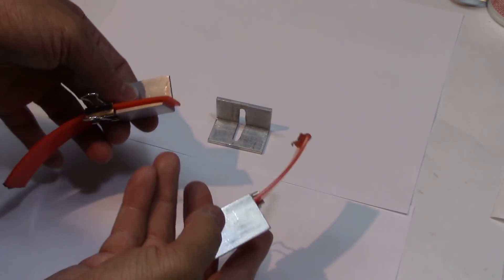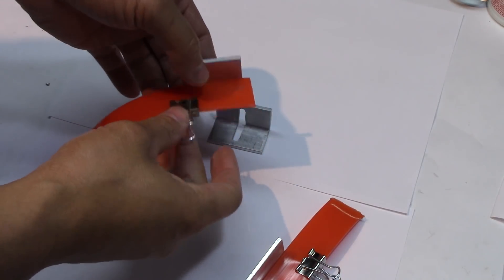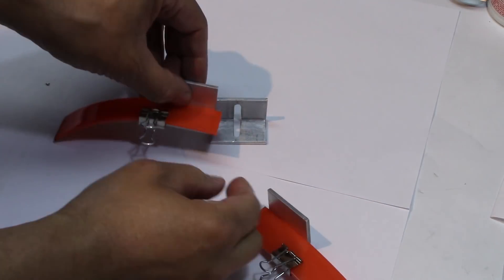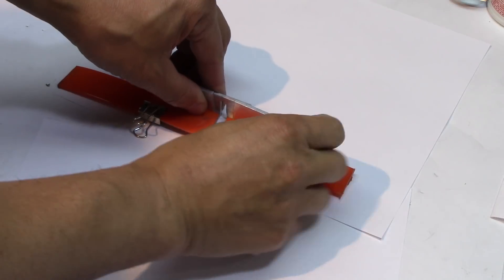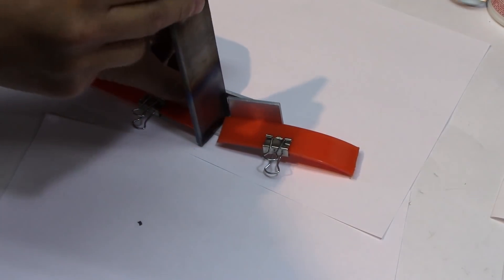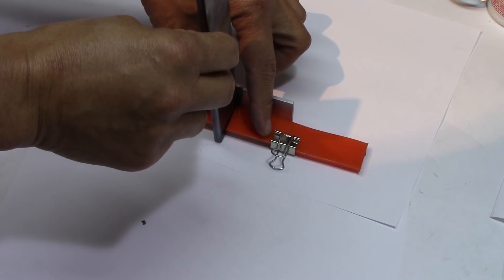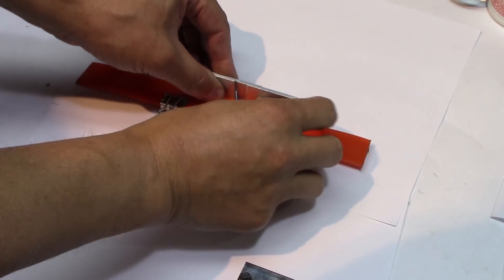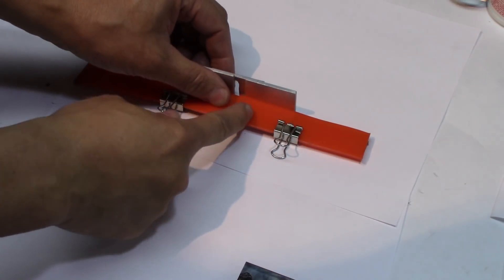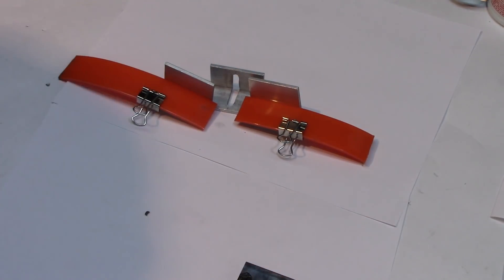Just a quick thing to show how I fasten those belts. I took two pieces of angle aluminum and clipped them on both ends of the belt, leaving a little left over on both undersides. Then I used this piece as a way to hold them while my son came in, heated a piece of iron until it got blue, and stuck it between them. I put both ends onto the hot iron until I saw them get a little soft and bubbly, pulled it off, slid it together and held it. You can see that that lines those belts up perfectly. I clamped it up and let it sit, then went and started trimming it off — that's how I did that.